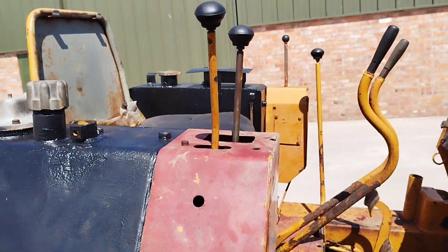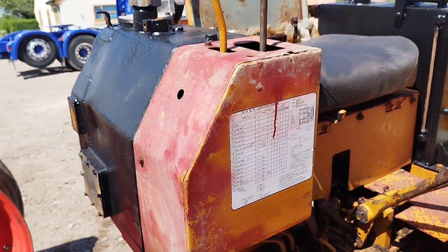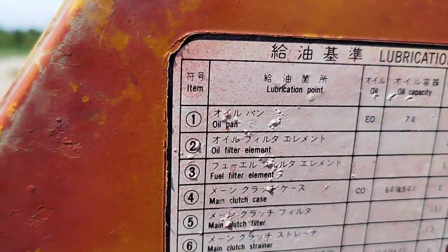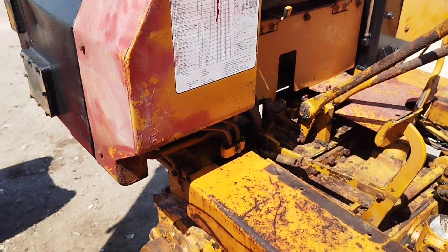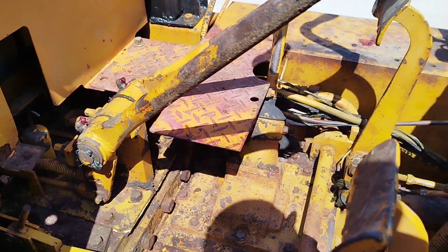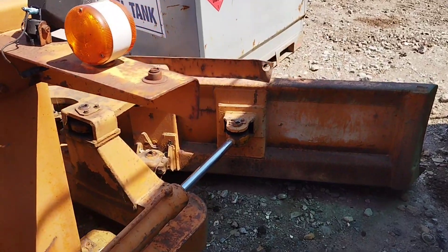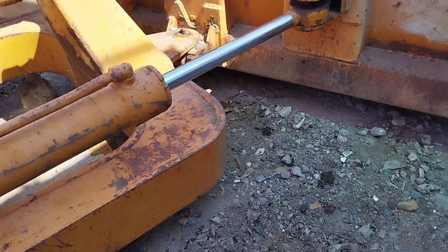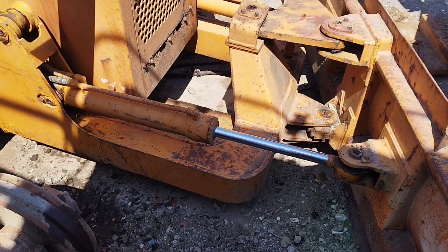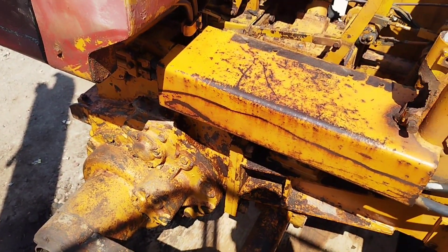Got this piece on, put that back on around the blade controls. When I flipped it up we put all the bolts in. On the underside I've actually found a bit of a diagram with all the points on the dozer for maintenance, and the chart that tells you what goes in there - engine oil, hydraulic oil, all that kind of good stuff. Greased everything under here, so when we put the floor back on everything you can't get at is greased. Greased all the blade - nothing took more than five or six squirts of grease, it really isn't worn out at all. To still have the paint on the bottom of the frame for the blade - the machine's done nothing, really. It was apparently used for clearing snow, which I do believe now, with all the paint being underneath even on the belly pans.